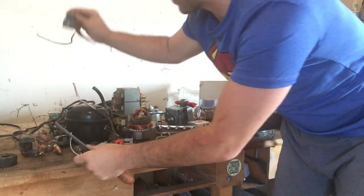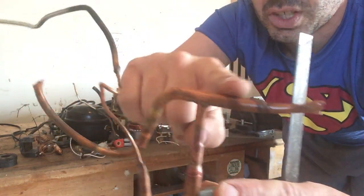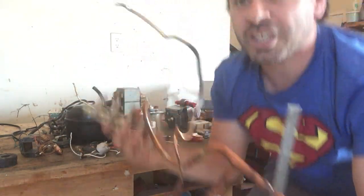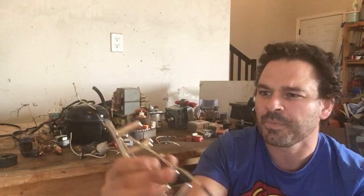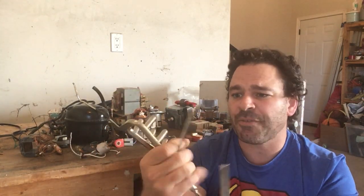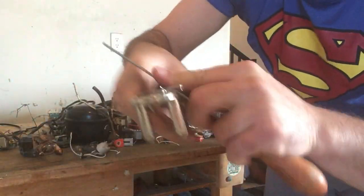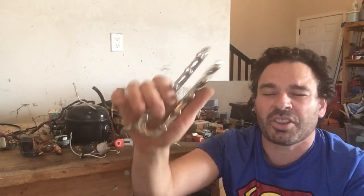Which brings me to the hoses from it. This hose is all copper — you can see it has soldering, so this is number two. The nice thing about ice makers is inside they have different prongs and pipes. With any type of copper pipes, especially the ones that go to your copper-aluminum radiators, some will have a steel or magnetic tube with it. So the first thing to do is put a magnet down it. You can see it is non-magnetic. If I scratch it, there's the copper — just a coating on it, but this gives me number two copper.